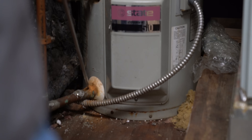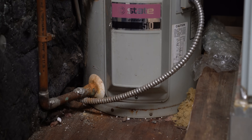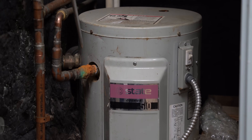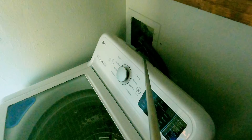If it is in the house, at that point I want to go to the water heater. I want to listen to the water heater, but I also want to be able to isolate it. If I can turn off the ball valve there, I know if the leak is on my hot or my cold line. Same way, go to the washing machine box, put gauges on there, have the system pressurized up, then shut the valve at the water heater. Whichever gauge goes down, that tells you where the leak is.